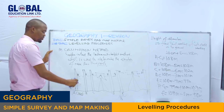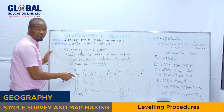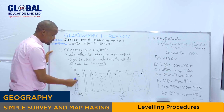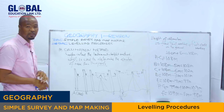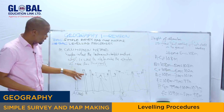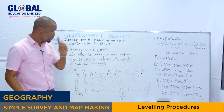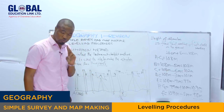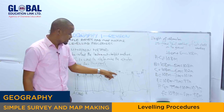For instance, right here I have taken 100 meter plus 8 meter, which is the staff reading. So 100 meter plus this one, you get 108 meter. That is our first height of collimation. Then you subtract the staff reading of each point to get what we call the reduced level. And if you find a point where two spirit levels have read that leveling staff,